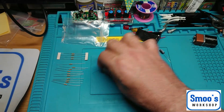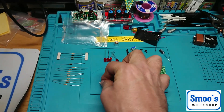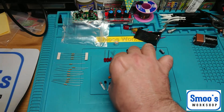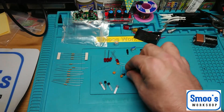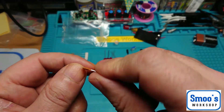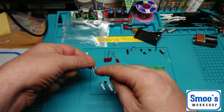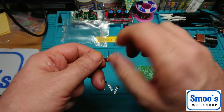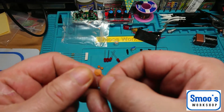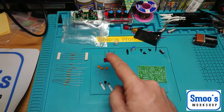We've got a couple of screws and four transistors. This is where the complexity comes in! Also quite interesting — in an audio circuit you don't normally want these ceramic disc capacitors because they're actually microphonic. They're all 104s, because if you build a circuit and tap these, they're like little microphones.